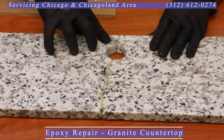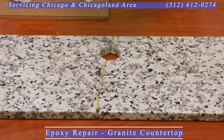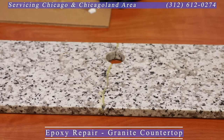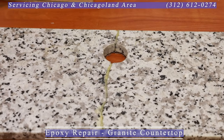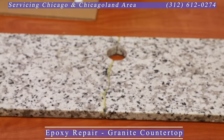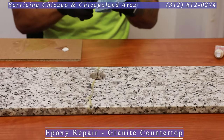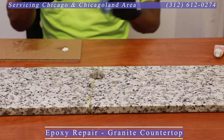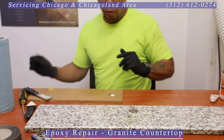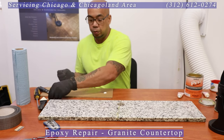Get it all on one surface — I'm only buttering one side, and that is sufficient. You don't need to butter both sides of the stone on a repair like this. Now I'm on a flat surface and that's important because we don't want our pieces to be beveled — that creates unevenness. I'm going to clean up as I'm doing it because this stuff will get hard, so I want to collect the activated epoxy with a paper towel and clean off my tools.